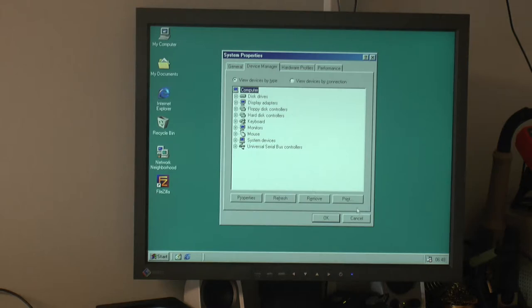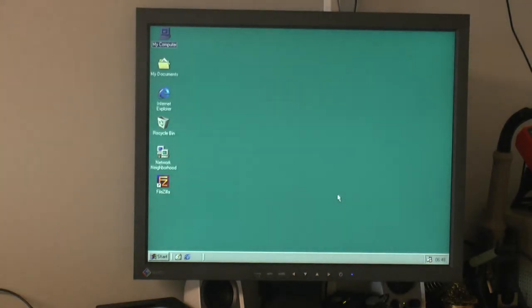The wizard doesn't find anything either, and it shouldn't have to be run because it's a plug and play card. So the A64 doesn't work. And it doesn't work with the DOS driver either. They just complain that there's no device. The IRQs and DMAs are wrong. And those work on my other system.